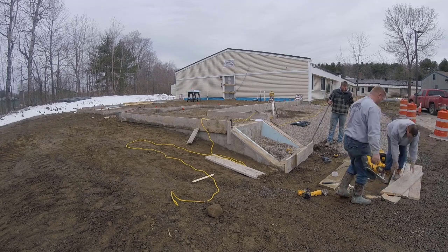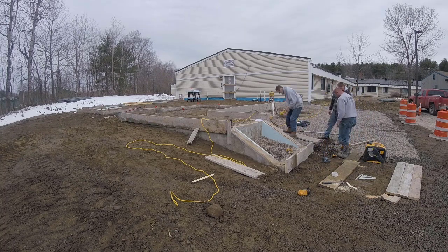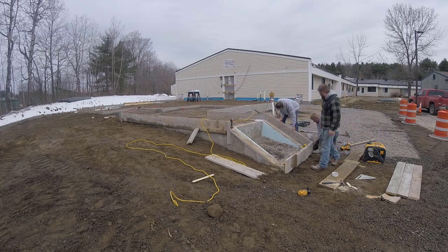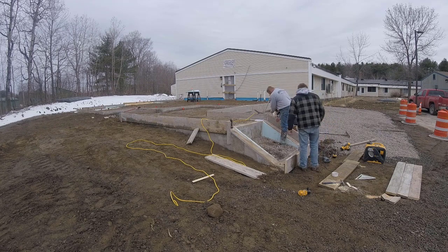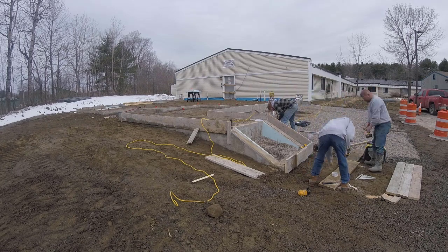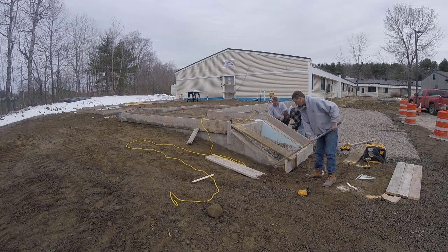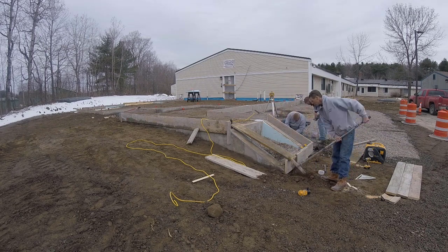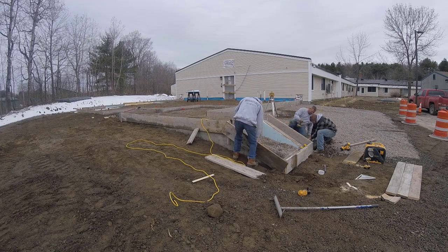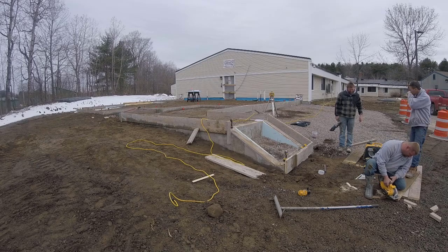So we just figured out the top angle for that board on the side. We held it in place even with the top of that bottom board and then even with the top of the patio, and we just marked the angle using the board on the side of the patio. Then we'll screw that one into place and Tapcon it to the concrete too. I'm figuring the length for that last side, digging out a little dirt — the bottom will be even with the bottom board, the top even with the top, and I'll mark the angle with a pencil and cut it at that angle.